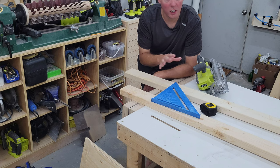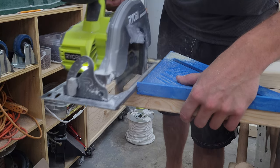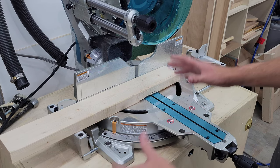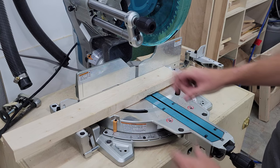With our circular saw and speed square we're going to be cutting to length our front and back rails. Next we're going to cut all our stretchers — these are the pieces that connect the front and back rails. These are going to be 21 inches long as our shelf is 24 inches deep; that's just 24 minus the three inches for the front and back two-by-four.